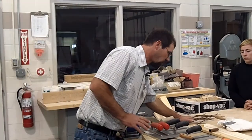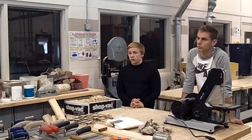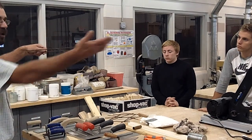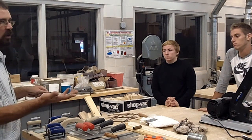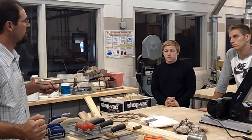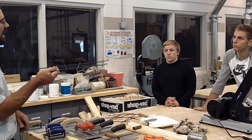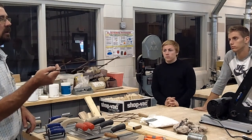So the way this stuff works normally is they make little stands. You could make up stands, put pieces of brick underneath it. But where would you want this in your concrete? The middle? The middle, preferably. But if you're out there walking in it, you're pushing it down. So every now and then, and even some of those come-alongs have a little hook welded on them, you can reach down with that come-along after you're done walking in that area and pull it up. I mean, you do your best to keep it up. I've busted a lot of concrete up, and a lot of times this sits right on the bottom, which is doing not much good. Then put it down, then put another layer on top.